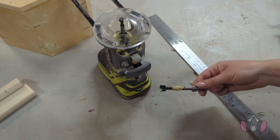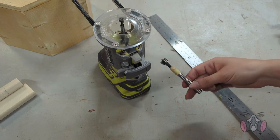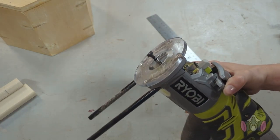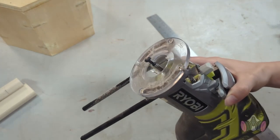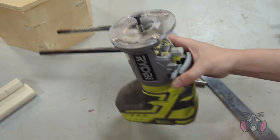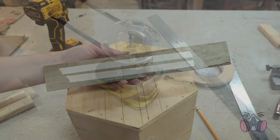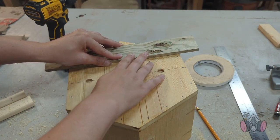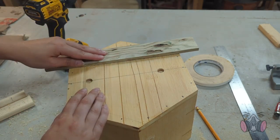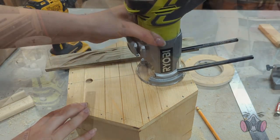Now that the inserts are done, back to the hexagon. Next, I have to be able to hang this thing up outside. I'll keep it simple and use a quarter-inch Forstner bit and a keyhole bit to make two keyholes in the back. I'm making two because they will secure the whole thing to the wall so it won't swing around if the wind is too strong. After I drill the holes, I use double stick tape to put down the guide for my router, because I want the keyholes to go straight up. Then I clamped the whole thing down and started routing.